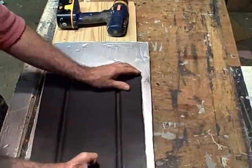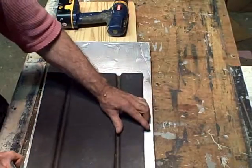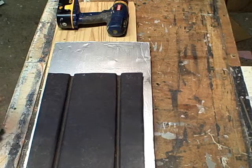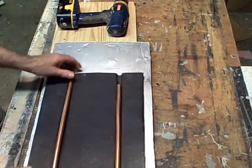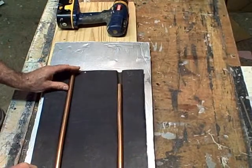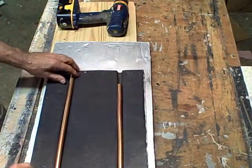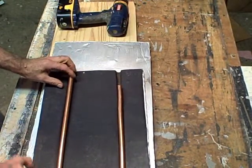It's best to actually glue the insulation to the back of your absorber plate with contact cement. The next thing to discuss is fastening your absorber plate to your collector. We want to have a good bond between the absorber plate and the flow tube. One way would be to use some kind of glue, but we need a little more than that because it's going to pop out — glue won't stick well to aluminum.